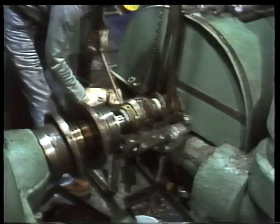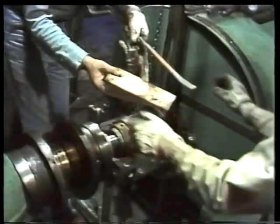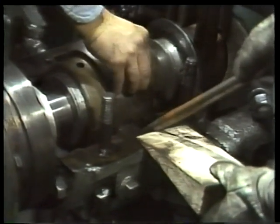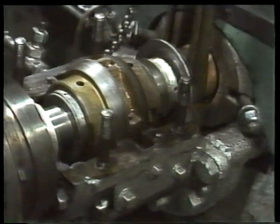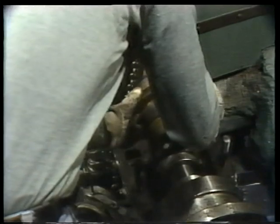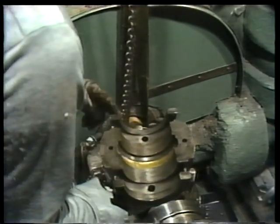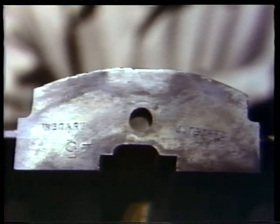On some bearings, you'd be able to rotate the shell and punch the pins out from the bottom. But since this upper shell isn't designed to rotate, we have to pry the pins out with a bar using a block of wood as a fulcrum. Never pry directly against the housing itself — you're too likely to damage it and prevent a good seal between the halves. Once the pins are out, the upper shell is ready to come off. The shell is stamped inboard and outboard so it's easy to put back in the right position. If you're working with parts that aren't stamped, make witness marks to ensure correct repositioning.